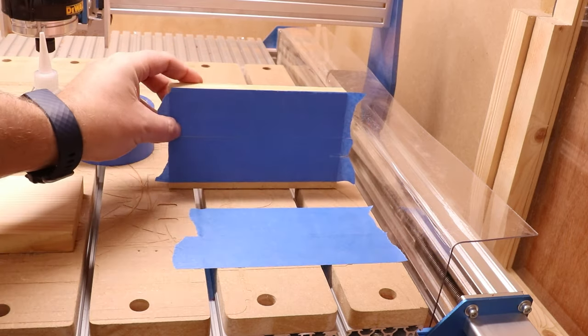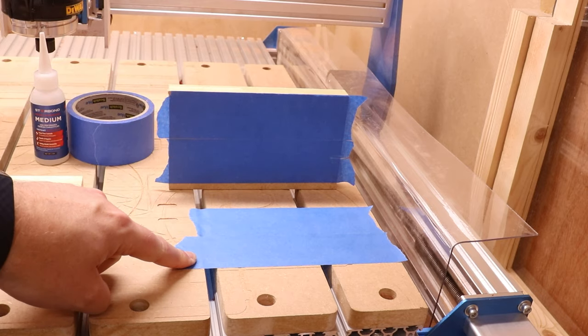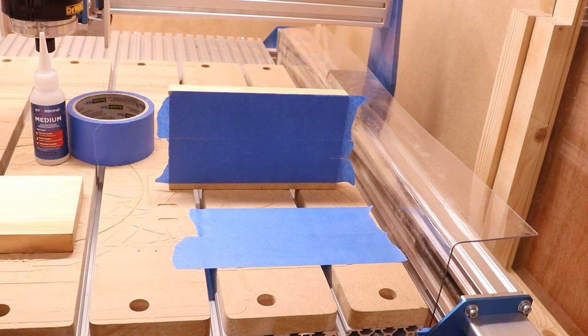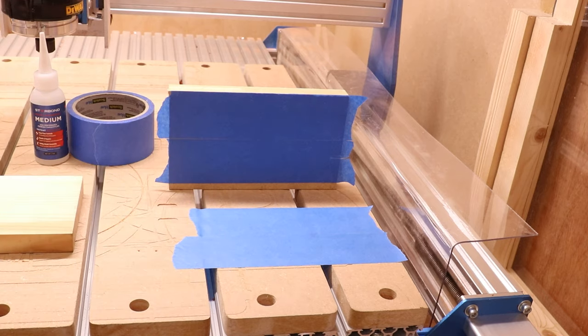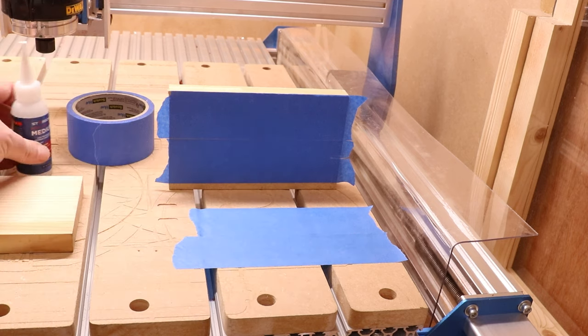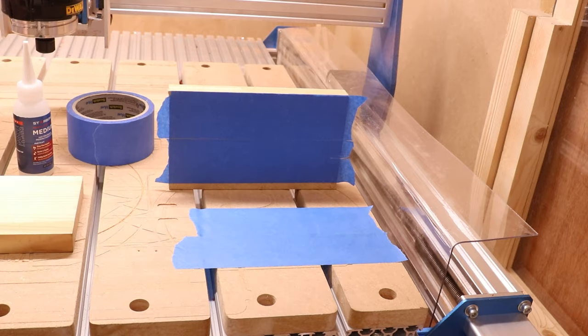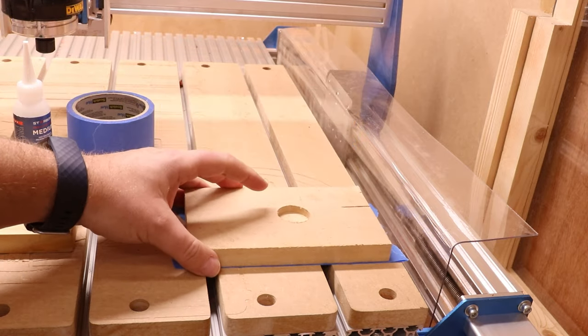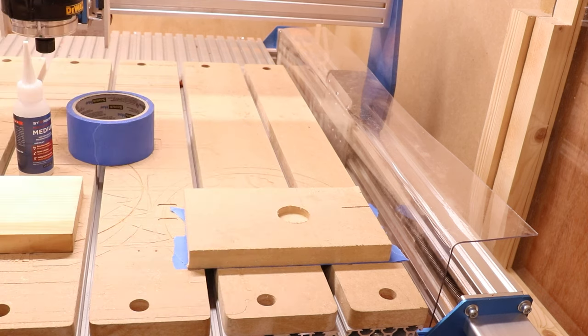How do we apply this? You apply a layer of blue tape to your material, then a layer of blue tape to your bed. The amount of tape is dependent on the size of the material — you may cover the whole area, space them out, or just put a single line of tape on. Next, you take the glue and apply a layer to that tape, then take the activator, spray it on the opposite side, push them together, apply a little bit of pressure, and within seconds they are held in position.